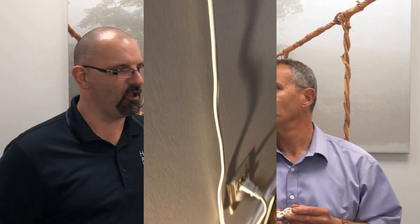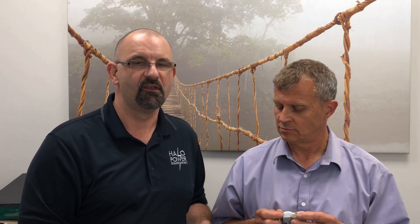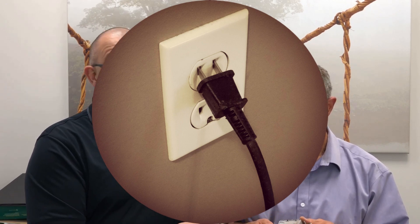If you've got a home that's about 20 years old and still has the original receptacles, you can imagine how many times devices have been plugged in and unplugged — vacuum cleaners, heaters, you name it. They get worn out. A real telltale sign in older homes is when you find a cord plugged into an outlet and it's literally just falling right out. That loose connection can also cause heat, which can result in something hopefully not as bad as this — but it is a real issue.